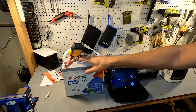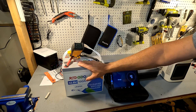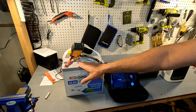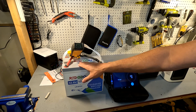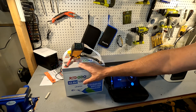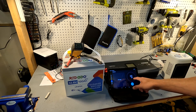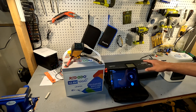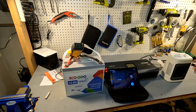Okay, here's what we're working with: a 100 amp hour 12 volt RedODO lithium iron phosphate battery, rated for 100 amp discharge — and we're actually probably going to be pulling around 150 amps. Hopefully it powers the heater for three minutes. We have a timer set, and in the back we have a LeastGuide 2000 watt pure sine wave inverter, which will power that 1500 watt heater with no problem.